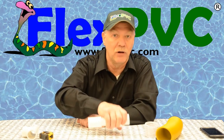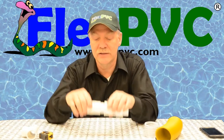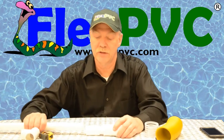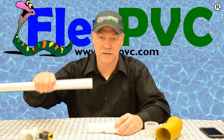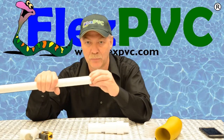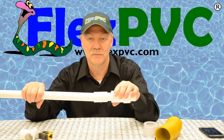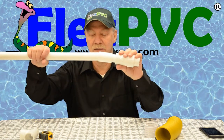One way you can tell it's bonded is to kind of twist it — if it moves at all, you're not bonded, so stop and let it bond up. Give it an hour if that's the situation. So now this is in here, and you're going to have another piece of pipe. You'll have about this gap. I recommend we have tools to bevel these — I'll put a link in the description — because it makes it a whole lot easier to get this started if you have a bevel, especially since a lot of times these pipes have cracks because they're not perfectly straight. There's some stress on them, and that's why they crack.